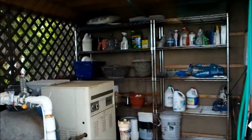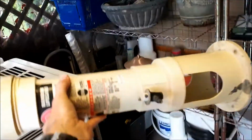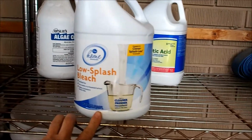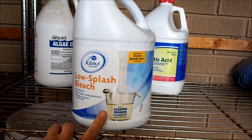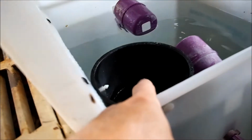Now most pool systems use chlorine pucks that they feed into the system with these puck feeders for various reasons, including cost and simpler chemistry. I use liquid bleach that you can buy at the grocery store. That's about 8% chlorine, $3 a gallon. All you do is put it into these liquid chlorinators, which are simply a big plastic bucket. Pour it in there, it sinks to the bottom. That's that yellow layer at the bottom. And this water becomes pretty highly chlorinated, and then that feeds into the pool system, controlled by this needle valve.